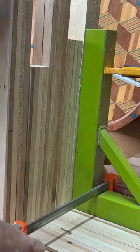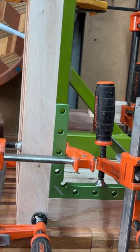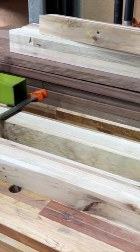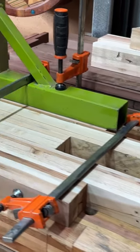I used to make these bricks way back when I did not have a thicknesser planer or a jointer. I would flatten all my slabs by hand with a router, then I would slice up the bricks on the table saw — remembering that there is nothing a belt sander can't fix.